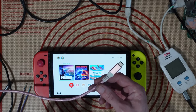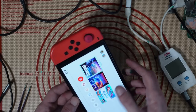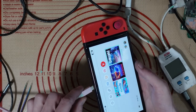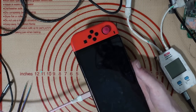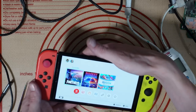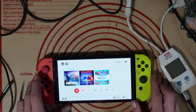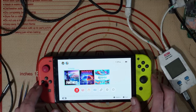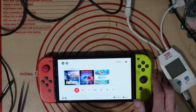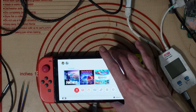I've got an extension cable here — a male-to-female Thunderbolt USB Type-C extension that goes to my dock. It turns the screen off and... here we go. Is it going to display? There we go! Boom — that's docking absolutely fine. Docking is working fine. That's brilliant news. The charging circuit is working perfectly, P13 is working, M92 appears to be working, and it's fast charging as well. Great to see. It's at 92% battery so it's only drawing 0.6 amps, which is perfectly normal.